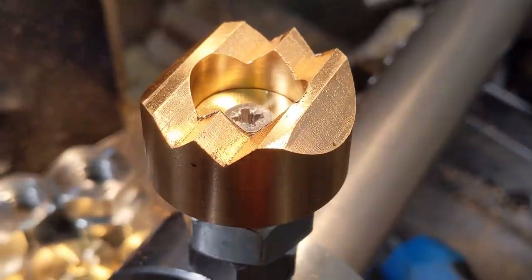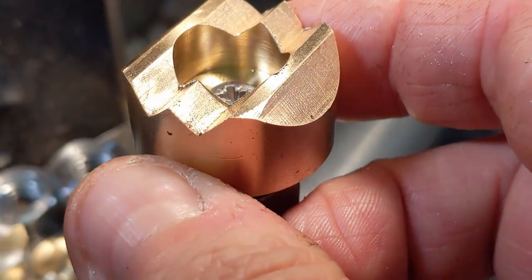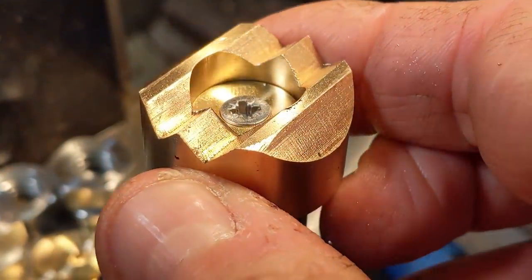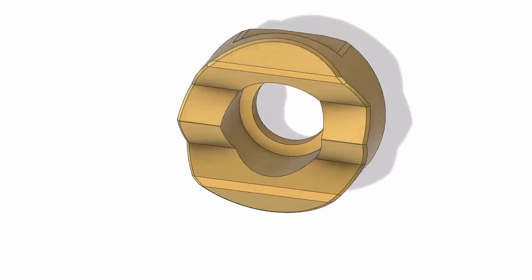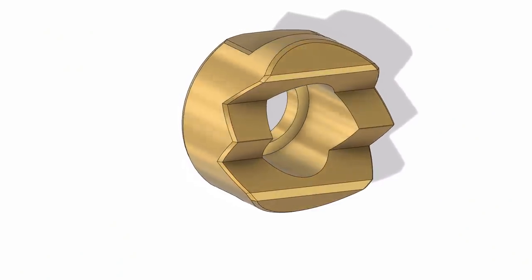The brass jaws are free to rotate about their bore axis to take up any surface imperfections inside the tube that's being machined. I need to have a way to prevent unwanted rotation while tightening up the lock nuts that apply pressure under the jaws. The simplest approach seems to be milling flats into the sides of the jaws, then I should be able to use an open wrench to hold the jaw in the right orientation.